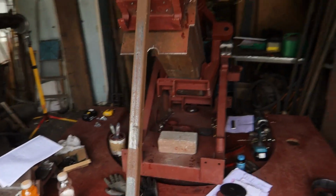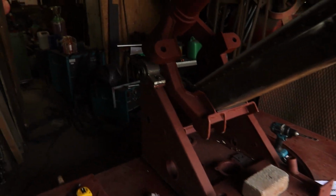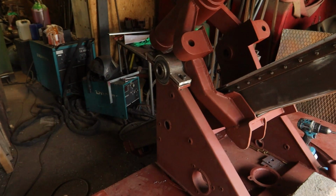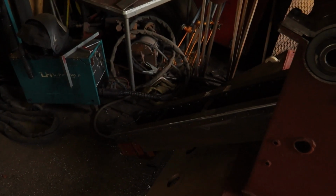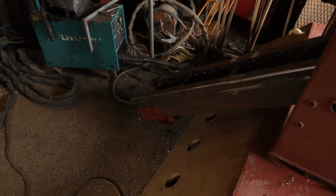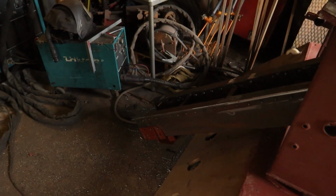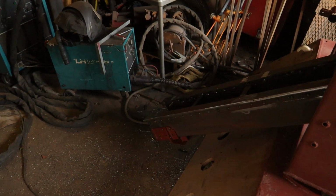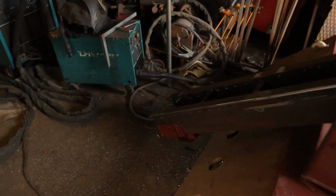And let's go to the other side. This is, by the way, the maximum elevation. Let's turn up the light a bit. And you can see it's barely touching the floor. It's just missing it, and if you would see that as the floor of the Nashorn, it would only have room for about 30 centimeters of recoil, but the floor is about 40 centimeters lower, so there's still plenty of room for the recoil.